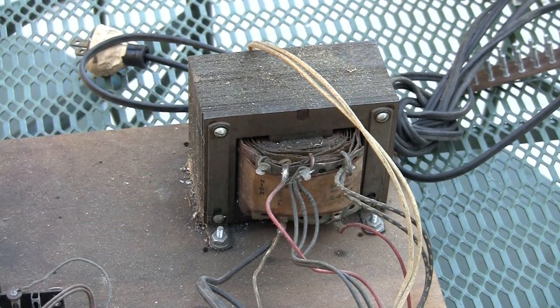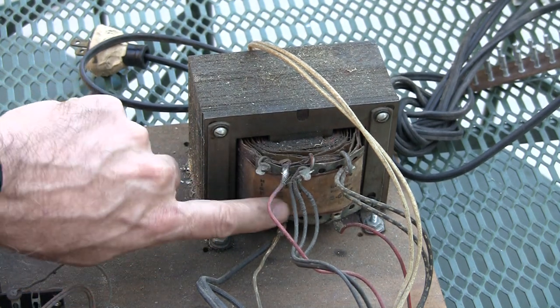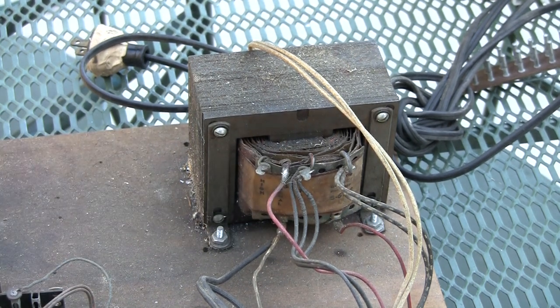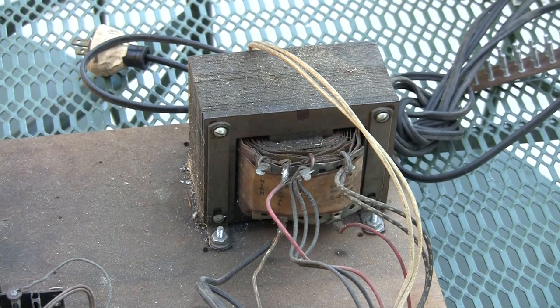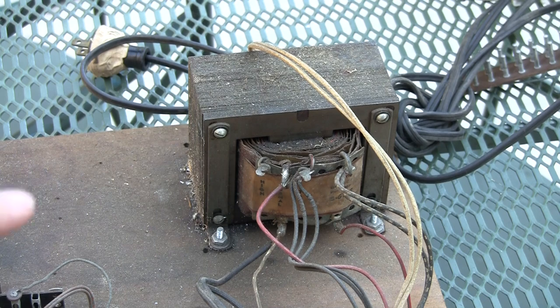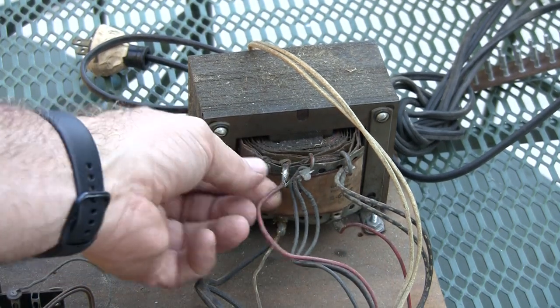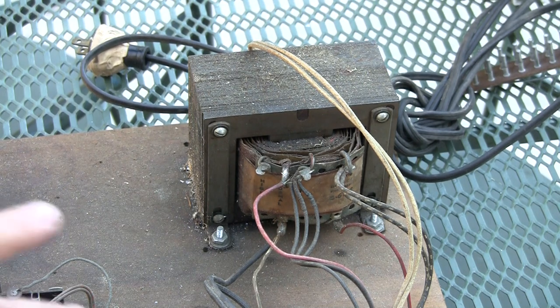You'll often see on these games — it says right down here — there's normal and high. That's what's called a high tap. If you wanted to make the coils in your EM stronger, you can move the leg from the normal over to the high tap. That's what they call high tapping, where it just adds a little bit more power to the flippers. There's a lot of arguments about whether or not that's worth doing, but that's what it is — the whole point of high tapping. You just desolder this and move it over there.